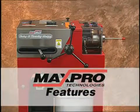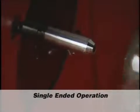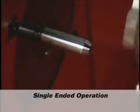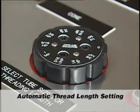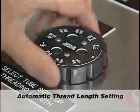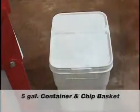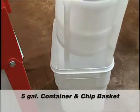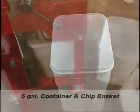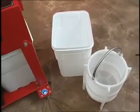Here are some of the many features on the MaxPro Technologies coning and threading machine. Single-ended operation for both coning and threading decreases production time. The dial for setting tube size decreases setup time by automatically setting the thread length. The cutting oil is delivered through the center of the drive shaft. The oil comes stored in a sealed five-gallon container, complete with a large-size removable chip basket. The holes in the removable basket allow the oil to drain, making it easy to clean out the metal chips with little to no mess.